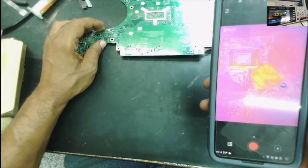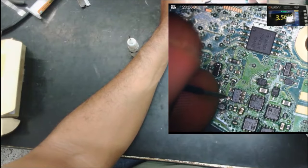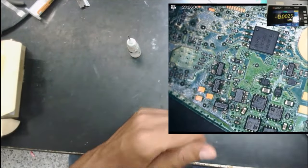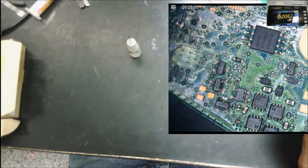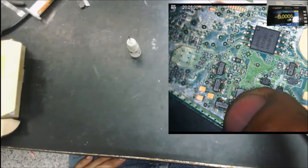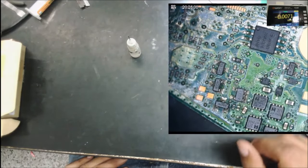This is adjusting voltage and the input is 17 volt. Must be this is the enable pin. Should be hot when the chip is on. And one of these is the output. So the output 1.2. This one 3.5. I'm not sure about that, 1.2 and 3.5. Now let me replace the chip. I'm going to take one from another board and see if that fixes the problem.